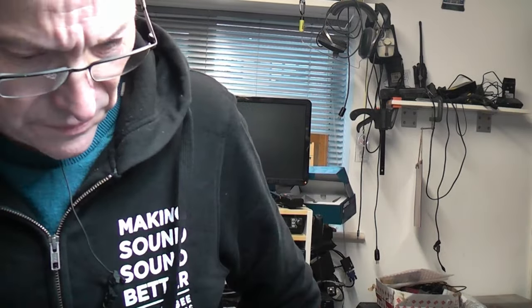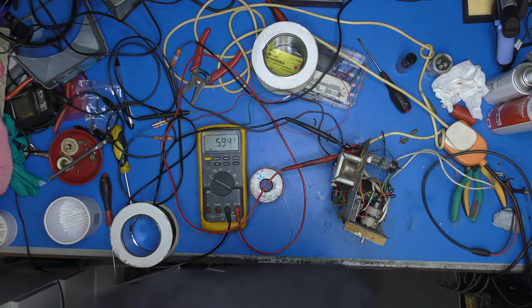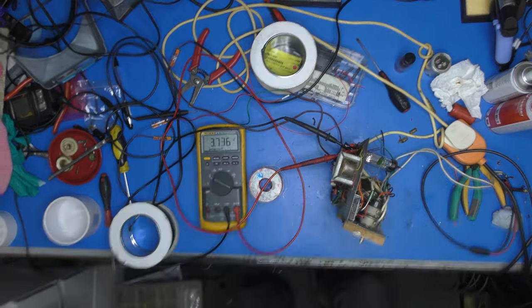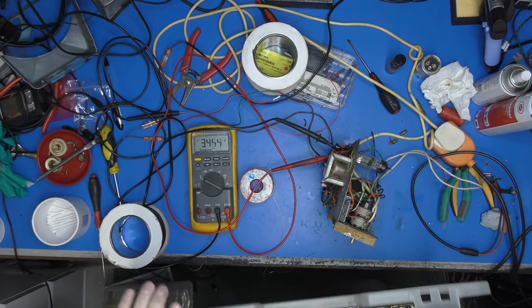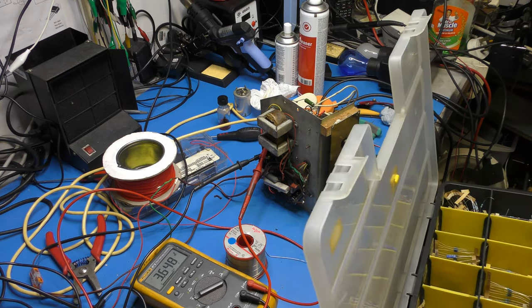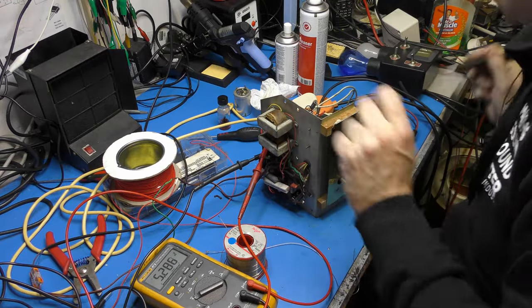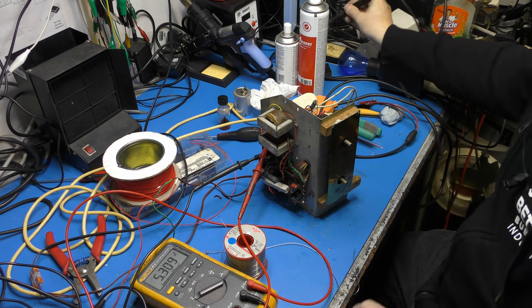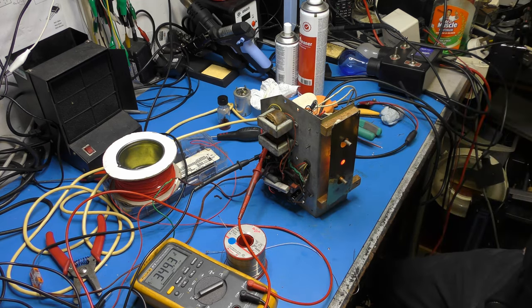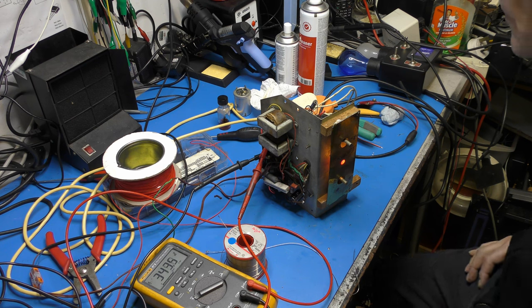Okay. Switch off and we'll pick a bigger value of resistance. Let's have 100, wasn't it? 200. Should we say 500? Dare I say it? What have I got? Okay, 470 ohms. Going straight on. And things start to conduct.